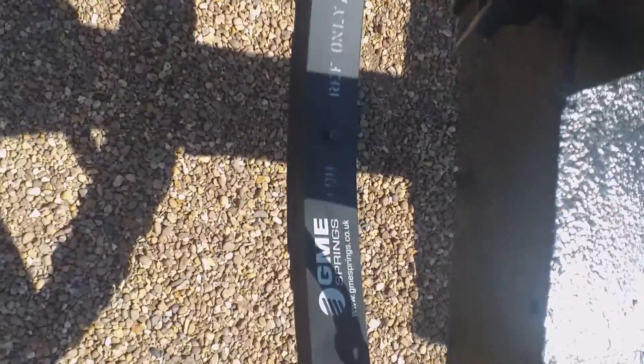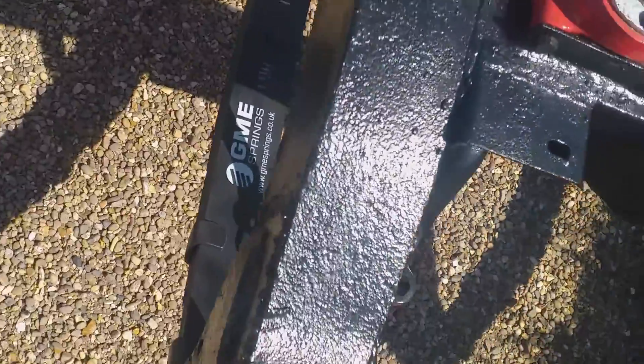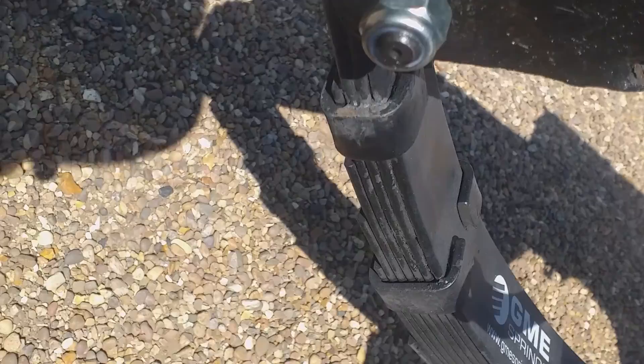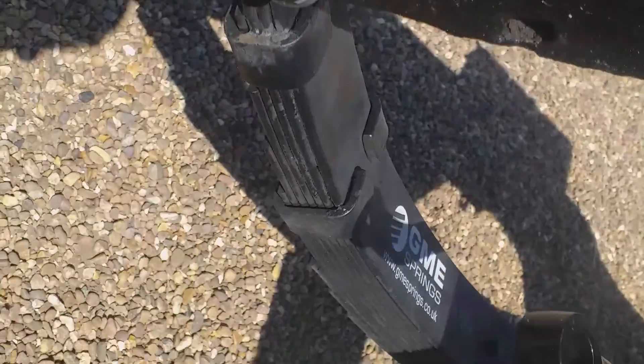That's a refurbished spring and this one here is a replacement spring. I had to go with a replacement because it was more cost effective than replacing just the second leaf — the first leaf inside the second spring which curls over the bush had broken off on the last one. So we've got a replacement spring, and it's all very good.